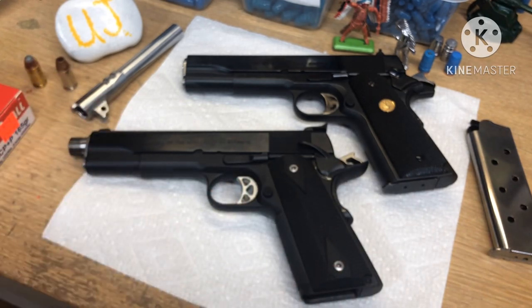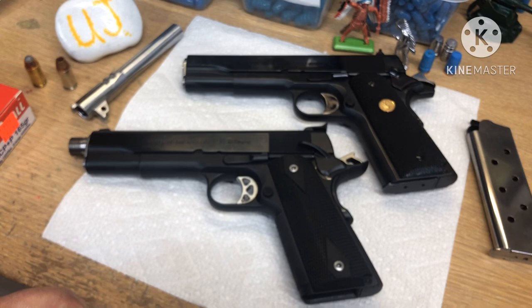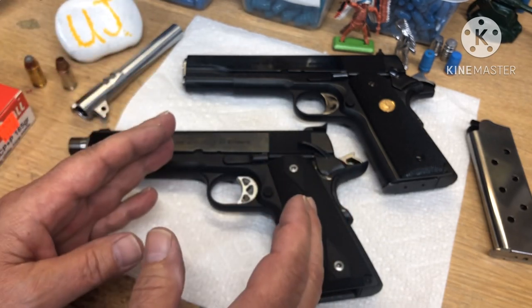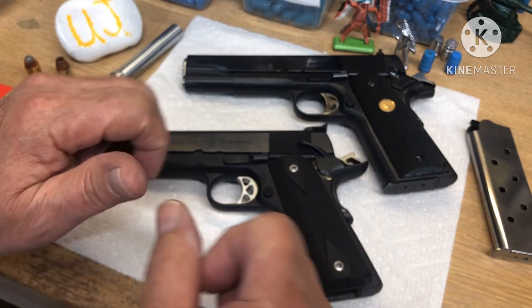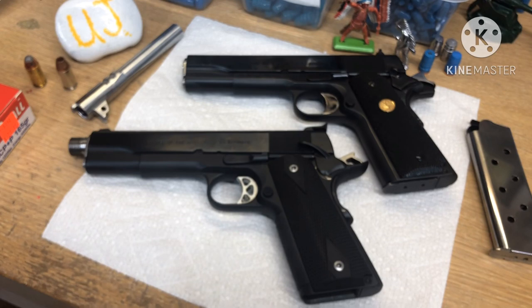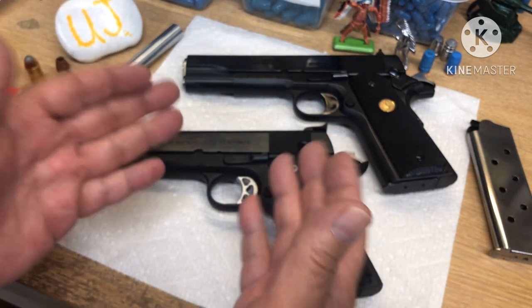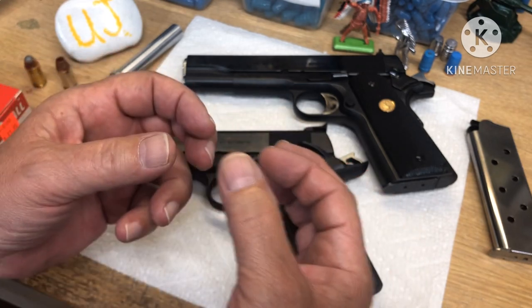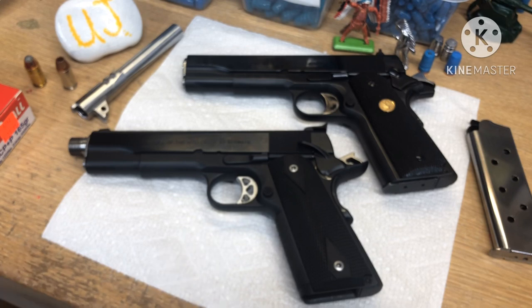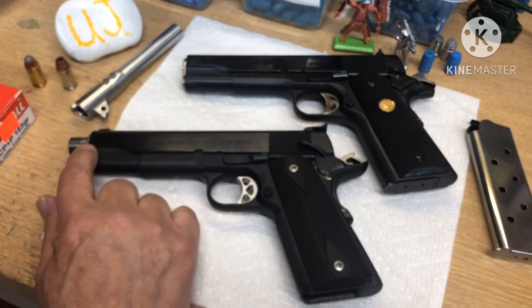These were great — $300 and they have mill marks inside, but that's how your GI World War II 1911s were. They were a great 1911 to work on, cheap, and all forged. You could even peen down the rails and then lap the slide so it's super tight — I never needed to go that far. Since they're forged you can do that safely; if it were cast they would crack. But that's a last resort for accuracy. The key factors are your lock-up, barrel, link, and bushing — those will suck those groups down.